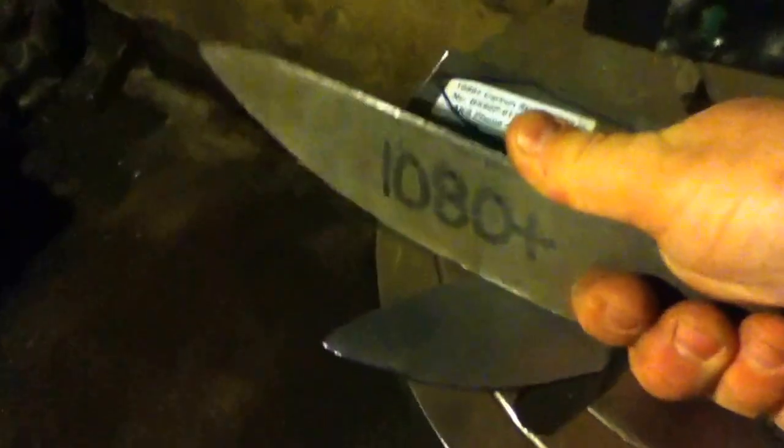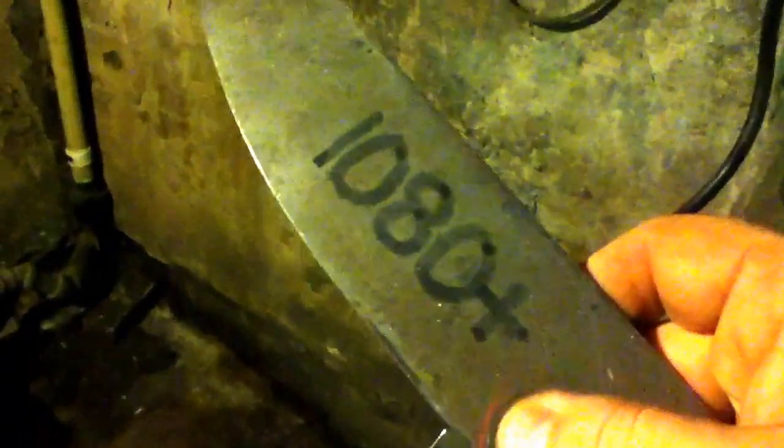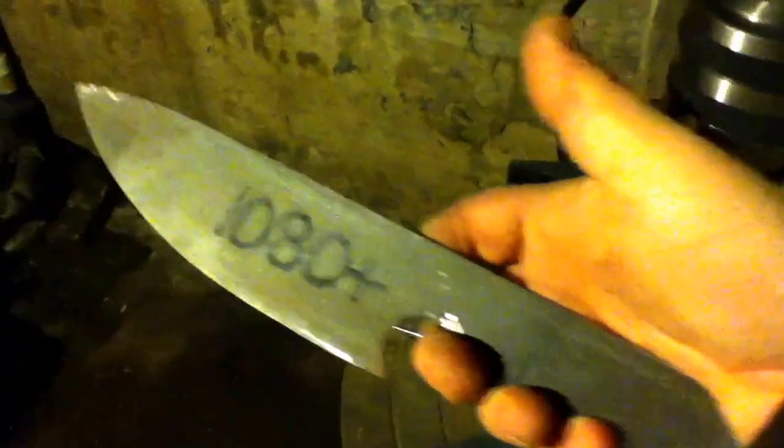And as a chef, there were certain things I wanted in a chef knife that I could never get. I always liked the idea of my finger being behind the blade. So I have a really deep ricasso, and that comes out to a point. I know that looks a little dangerous, but I'm going to bring the handle material around in there and round it off so it's actually not going to feel sharp at all, but that edge will come right to the end. And so I got a little shape going on there.